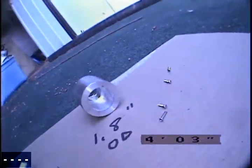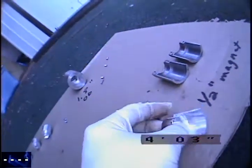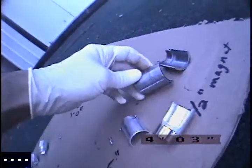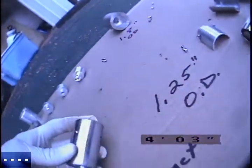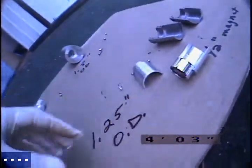This is the one we have on the camera head right now. We have some smaller versions here. This is a small 3/4-inch magnet with a half-inch in length; the outside diameter of the steel shell is 1.25 inches. And then we have the same one here but with a 1-inch long magnet, 3/4 inch in diameter — same as this magnet.